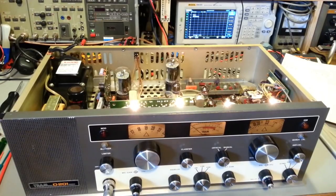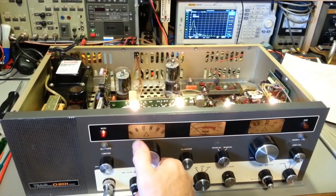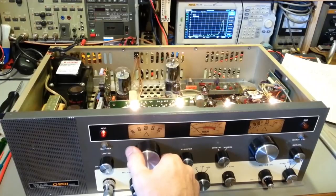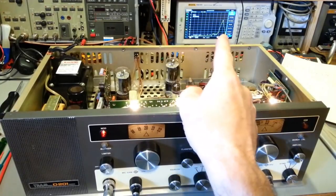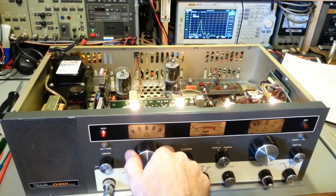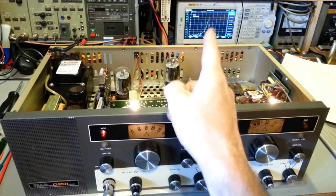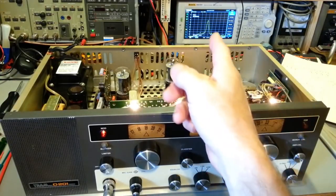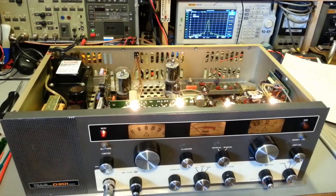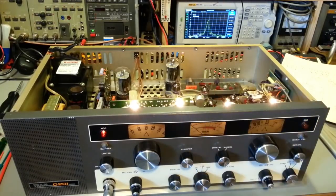Like I say, got transmit power now. So there's channel 19, 18, 17, 18, 19, 20. And if you're wondering why there's a huge jump between 19 and 20, and there's not between 19 to 18 to 17, that's because there's actually a missing channel between channel 19 and 20. People call it the A channel. There is no 27.195 in CB. So that's why that skip is there.